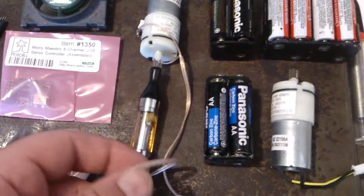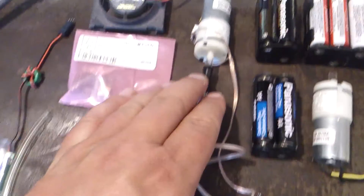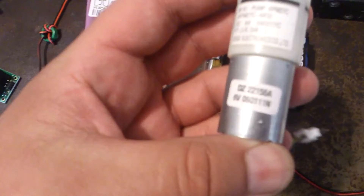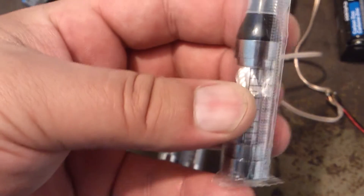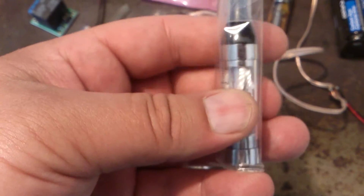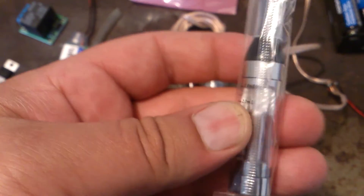This is a completed unit — basically the wiring is set up and it's a functioning unit. We're looking at a 6-volt aquarium pump. It looks something like this; I bought it off eBay. That's number one. You need some airflow to go through the cartomizers. These are Kanger — K-A-N-G-E-R — T2 cartomizers, and they usually run at about 3.7 volts. I'm running them at 6, which may blow them out quicker, but they produce a lot of smoke. I'll be doing two sets of these on each side.